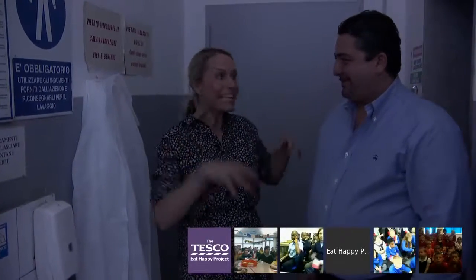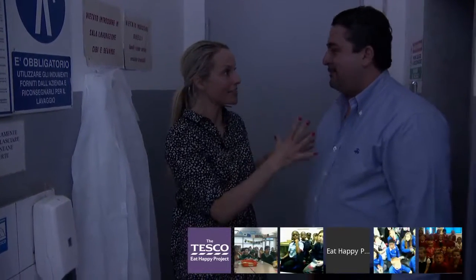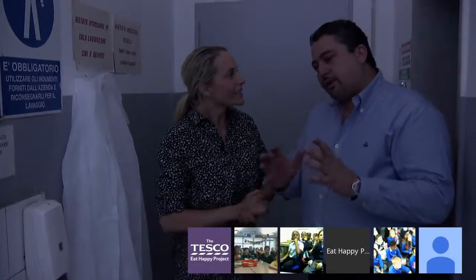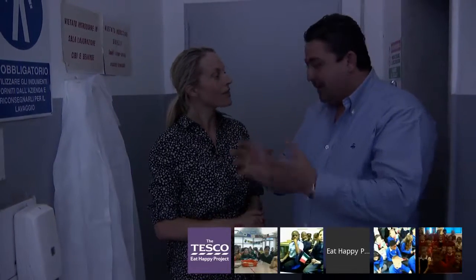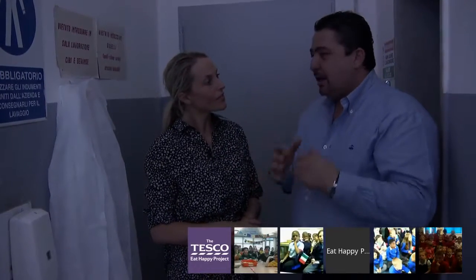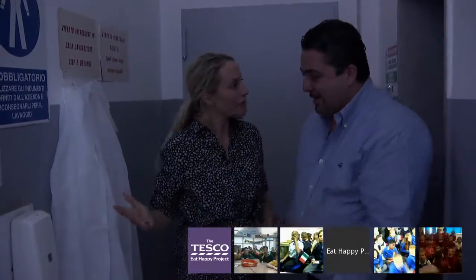We've now moved from the roof and we're inside the factory — you can probably hear the noise behind me. That is where the machines are making the pasta. It's going to be really loud. What are we going to see inside? We're going to see how pasta is really produced — the big machine where mixing happens between durum wheat semolina and water. Then it's pressed at very high pressure through dies that give the pasta its shape, cut to the length we want, and then dried slowly inside ovens where the water comes out and you get a dry product that is stable for two years.